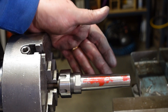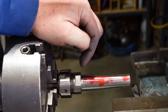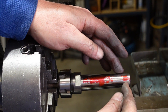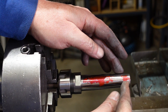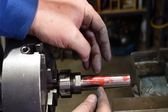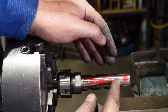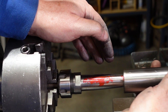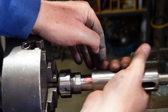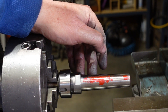There's the finished result. I've given that a bit of a polish with some emery to try and get some of my tool marks out of it. When I put some whiteboard marker on there and then ran the sleeve over the top, where I had to re-engage you can see there's a little bit of variation, but I've got good contact there, reasonable contact there, reasonable contact there, and some through here - so it's reasonably uniform. There's still a bit of a high spot but when you try that in the spindle it's quite solid, so I don't think there's a problem. There's a bit of tooling for the mill - thanks for watching, see you for the next one.